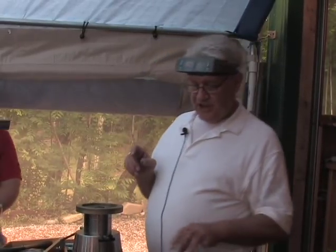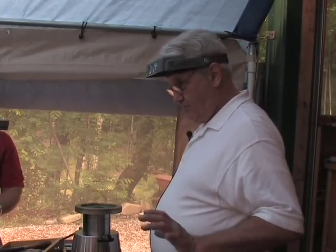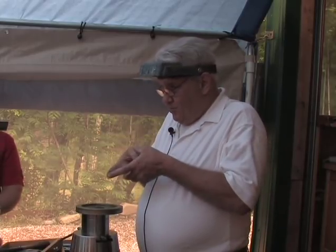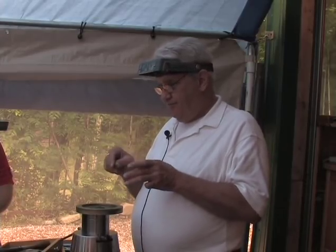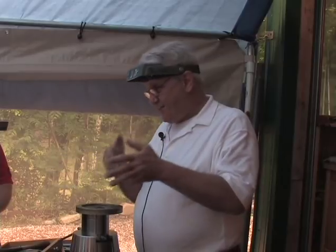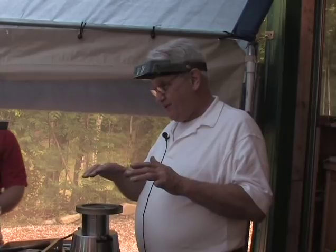What I do is I sharpen my bits using the first stone on my power hone, and I get the shape down to where I want it, and then I come back with this and touch only the belly that comes to the point on the bottom side. I seldom try to do the face, because if you've just sharpened your tool off of this one and you try to place it on this, you're making facets all over the place. Seldom do you get the same angle that you did the first time. Once in a while you're lucky and it comes out all right.